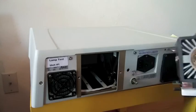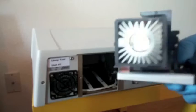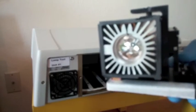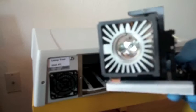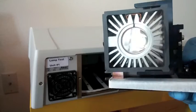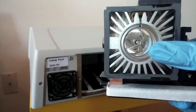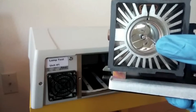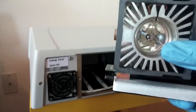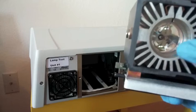At this point, there are two things that you can do with this lamp module. You can throw it in the trash and buy a new lamp module from Alcon. Or you can send it to us, Hatteras Technologies. We will refurbish the central element here, which is the Ceramax Xenon lamp, with a brand new identical lamp — we buy it from the same manufacturer. And then we use a sophisticated laser alignment fixture to align the lamp module to specs that are better than any other currently on the market. So save money and refurbish, rather than trash it.